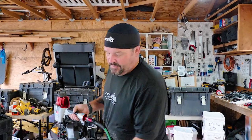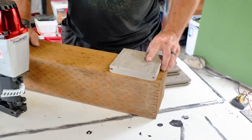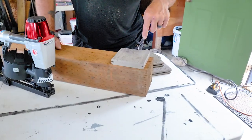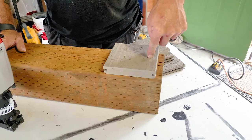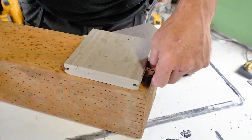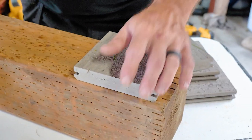That's an overview of the gun. For demonstration purposes today, we're just going to imagine this is a two-by joist. When you're running a hidden fastener system, you usually pin the end of your decking with a Cortex or something, or you can use a special end clip — they make one for that. We'll just say we Cortexed the end.